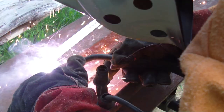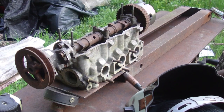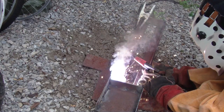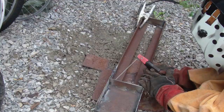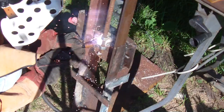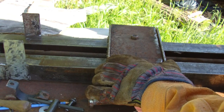I added some quarter-inch plate to hold the head on top of the angle iron, because the angle iron wasn't long enough. I ended up using the arc welder and threw a couple of thicker welds into the frame — the ways. I put the carriage together, tacked it, placed it on top of the angle iron, welded some nuts onto it, and added the threaded rod so it could move the carriage up and down. Greased it and it was able to move.